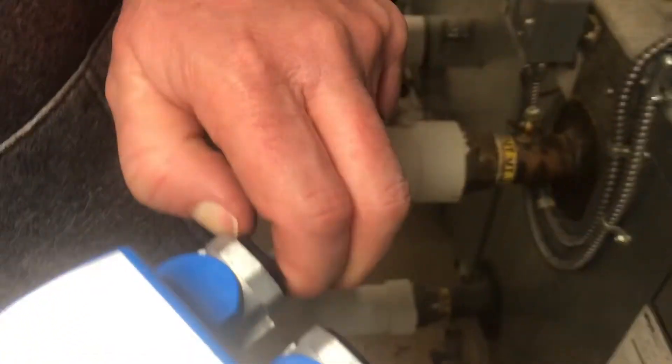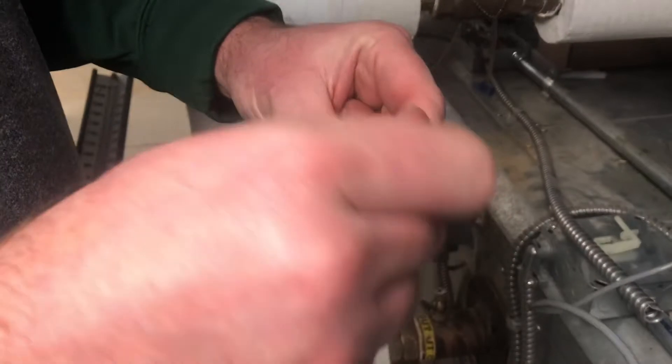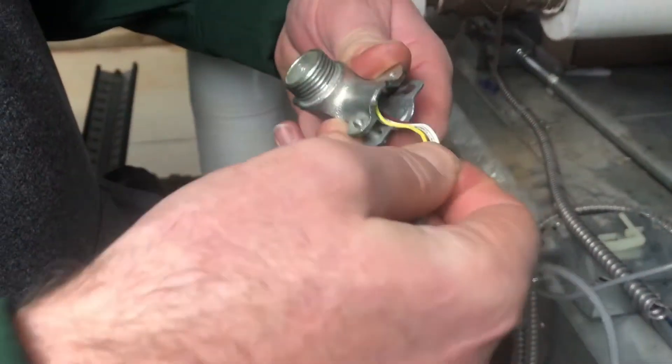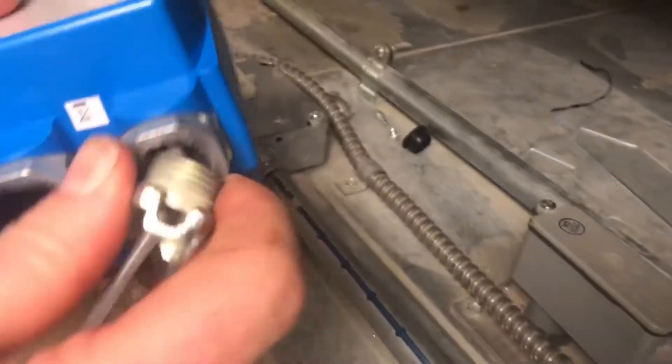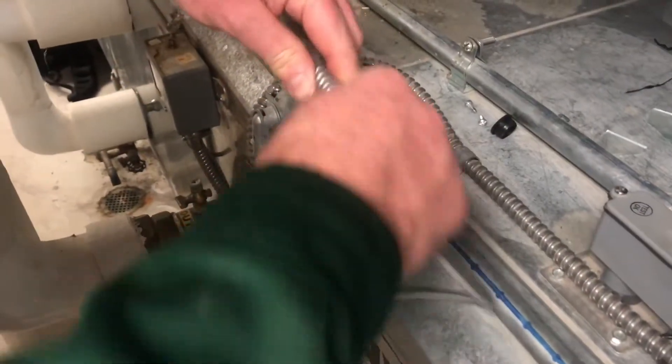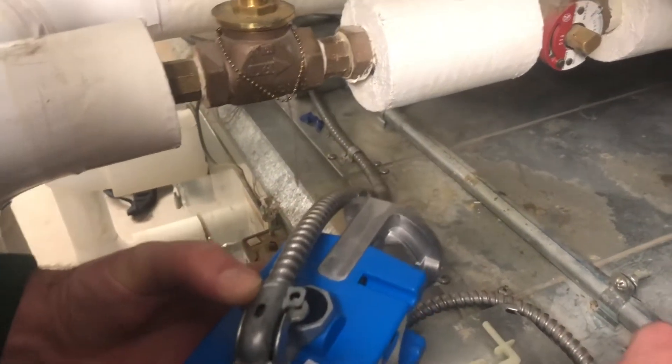Move the rubber plug where the wire goes into the actuator so we can thread our armor flex 90 like it was originally installed. We'll slide the wire through the armor flex back to the junction box, then put the wire run cover back on the armor flex 90, locking it back in.